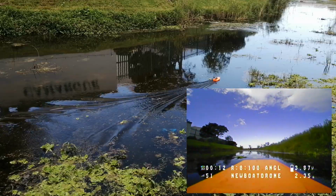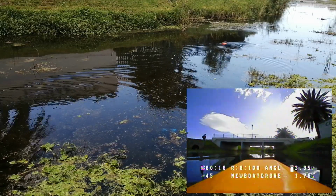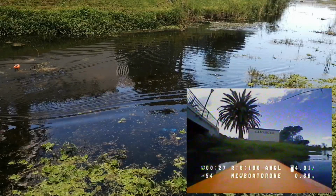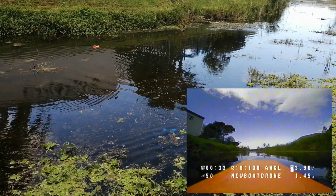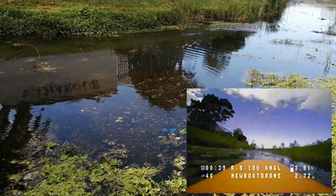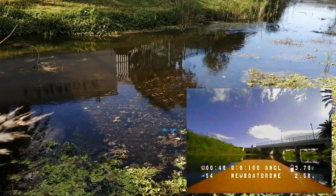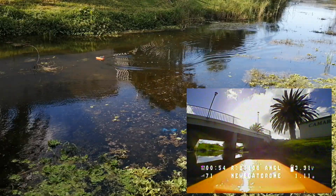I'd love to see anybody who does actually go ahead and build this thing against my recommendations and puts your electronics on the line, as it's kind of fun to buzz around. The biggest problem with it really is the fact that when the antenna gets wet, it really messes with your signal, quite obviously. So if you could find a way to keep the antenna from getting wet, that would be ideal. And again, also, even having water on the board when it's properly conformally coated can mess up all the carefully designed RF circuitry on there and also affect your video quite badly. In reality, perhaps a micro airboat is not the best idea, but it was pretty fun to do anyway.